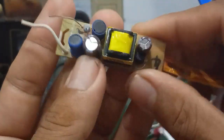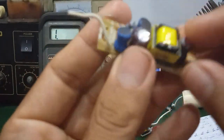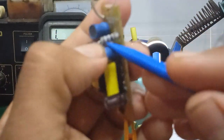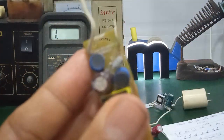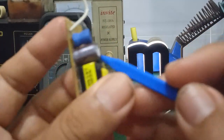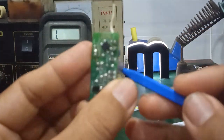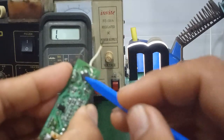The circuit design is quite simple. Here are the two AC 220V input wires. This is a 10-ohm resistor, which serves as a fuse resistor. These two components are the filter coils to suppress input noise. This is the filter capacitor rated at 310V DC, placed after the rectifier. This 4-pin component is the bridge rectifier diode.